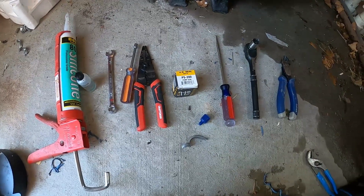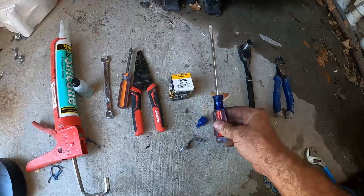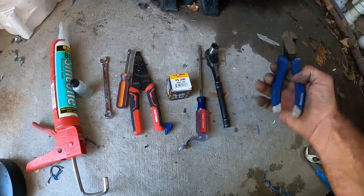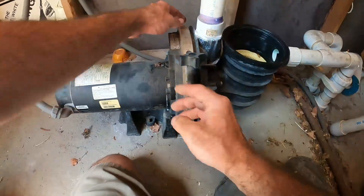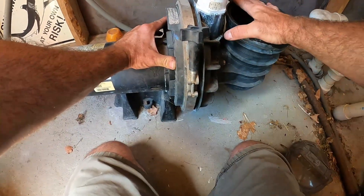For other motors you'll have to check by the motor model number — it could be a 100 or a 201. You'll also need a flat-head screwdriver, a 9/16 socket, a pair of wire cutters, and channel locks. The first thing we're gonna do is take our lock ring off, which basically holds our motor and motor plate to the actual wet end of the pump.